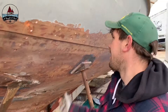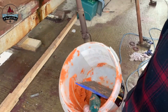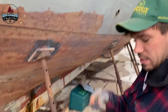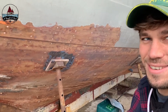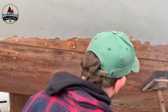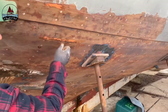What are you doing today? I'm going around filling all the holes. With what? This is linseed window putty mixed with cayenne pepper, window putty and red lead. Cayenne pepper stops the worms from eating it. Red lead makes it red. That's all I know. And the window putty is really good for being a flexible filler with these little gaps. So I've got to do 120 feet of it.